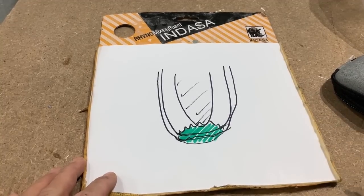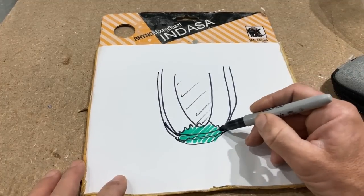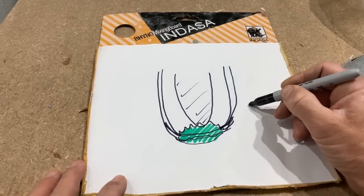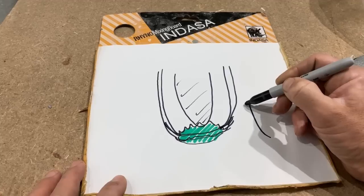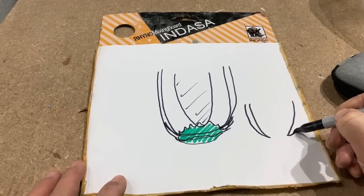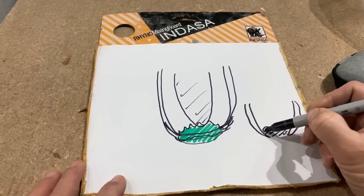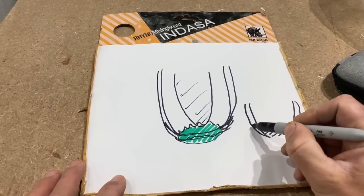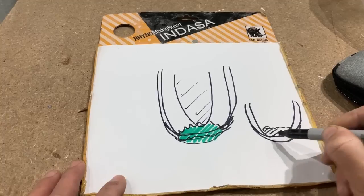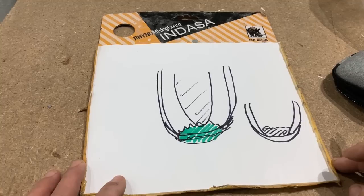In terms of cutting the glass, because I want to build up thickness, I'm gonna have to grind these sides back so I've got a nice taper. It's not a very good picture, but I'm gonna end up with something with a taper like that. That's going to be my new material that I've put in there, and then I'm going to lay up a new glass layer like this. So it's going to be tapered, and hopefully get a nice new bond, and we'll end up with a nice new front bit of keel there.